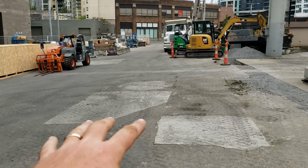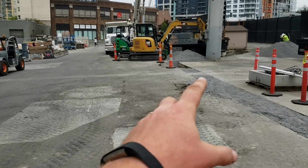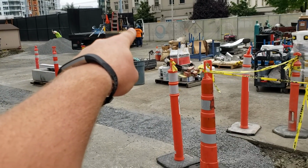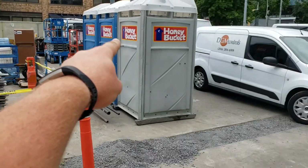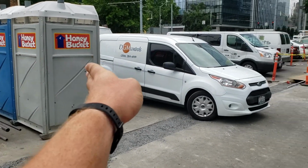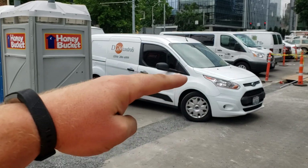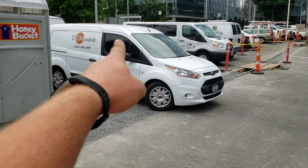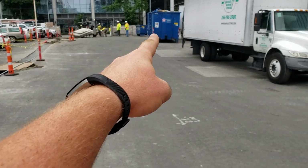Now, some good things about this, if you pull up the aerial, you'll see that's all new R&R, and then we have full depth patches from that point almost halfway to the rest of the lot. So we'll just pave that low so we don't have to grind it. Some we're just gonna have to grind around there, and I'll show you all that at the front.